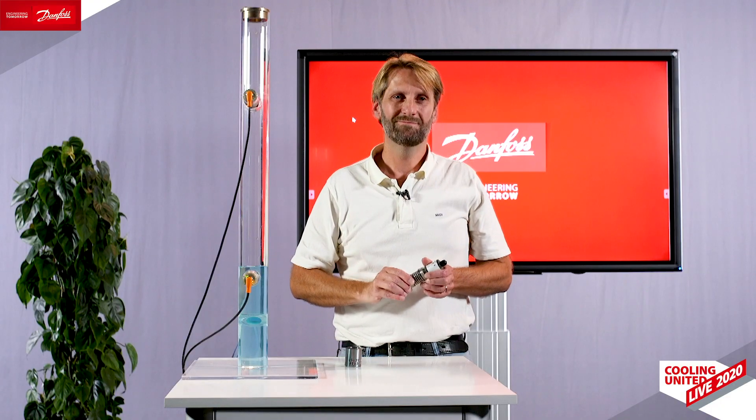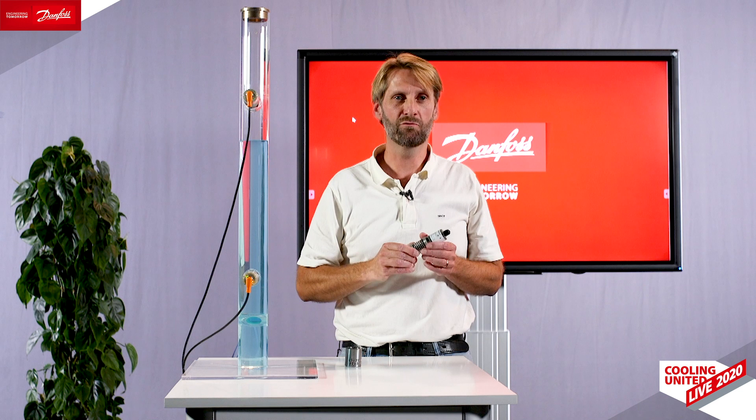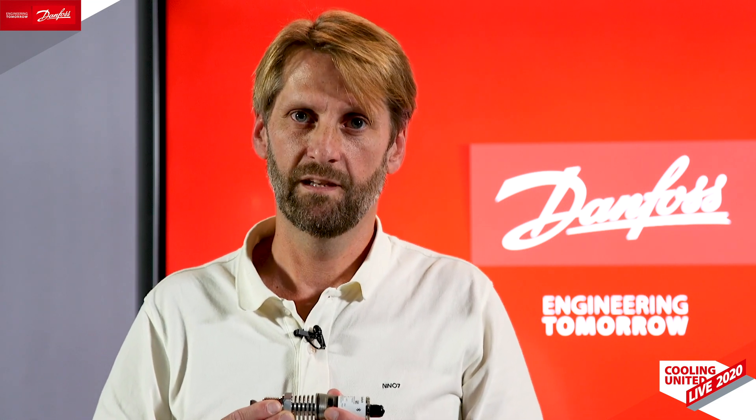So all in all, we believe it's time to switch — whether we are talking about new installations or retrofitting your old system. It's time to switch to this reliable product, which has a SIL design and a single-point connection that is very easy to install. It's currently available for ammonia and a number of freon types. Very soon we will also have it available for CO2, refrigerant oils, and R1234ZE. On top of that, we are also increasing the pressure rating to 140 bar. Thank you for watching, and have a nice day.